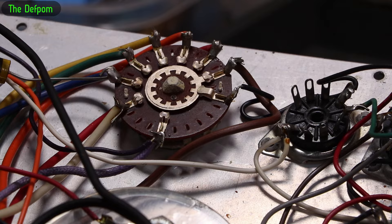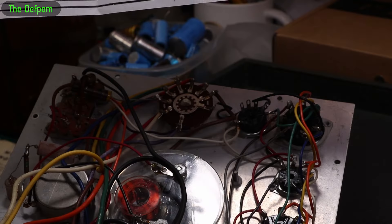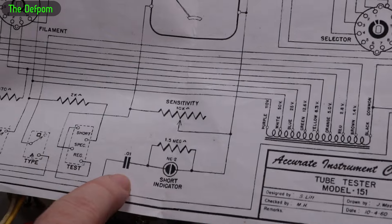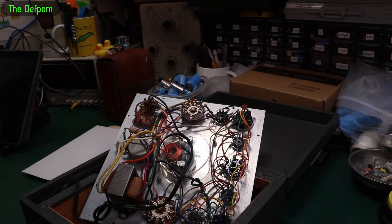Let's check the sticker diagram - it's a short indicator. Yes, there is a capacitor here. There's that bulb I'm looking at - it's a neon, I think, with a 1.5 meg resistor across it. There's the capacitor there which is looking rather unhealthy. This one's going to be fairly straightforward to sort out.